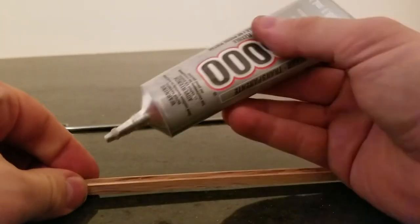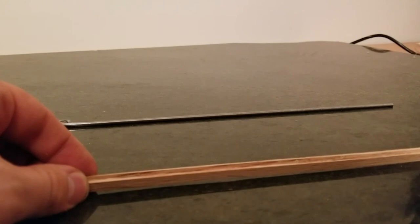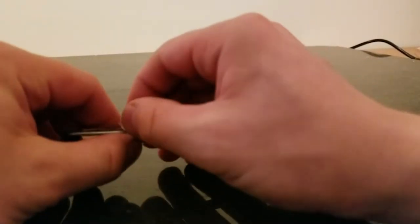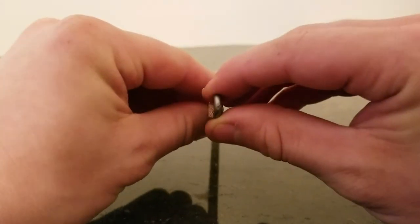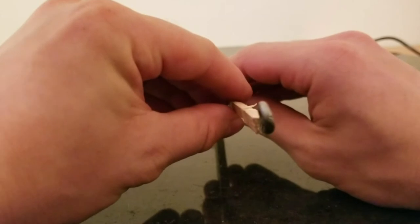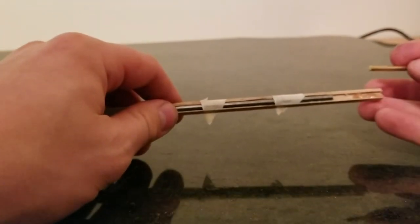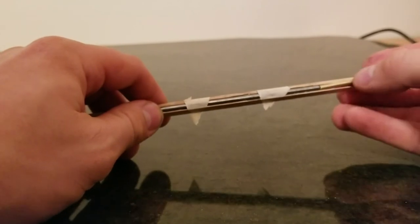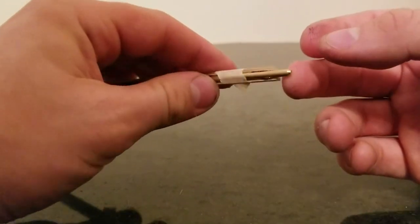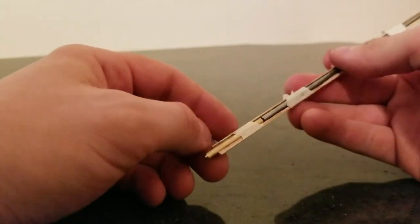To connect the wooden and metal parts of the slats, start with a bead of glue down the length of the groove. Any glue will do as long as it can stick to both metal and wood and has some flexibility when it dries, but I'm personally fond of E6000. Place the steel rod inside the groove and tape it in place. Check to make sure the rod is aligned properly — you want the loop to be parallel to the straight edge of the wood. Finish taping the rod in and double-check that you haven't lost the correct orientation. Since we turned part of the steel rod into a loop, you'll notice that it won't go the full length of the wood. I've prepared short segments from the brass rod we set aside earlier to fill the gap. The metal needs to stick out about a quarter inch beyond the end of the wood, making it visible, and brass just looks better. I also beveled the ends of the brass pieces to make them better looking and easier to handle.